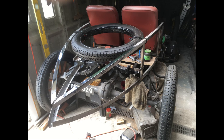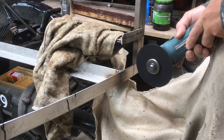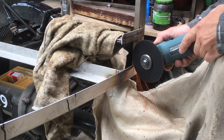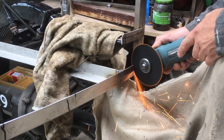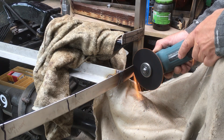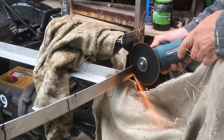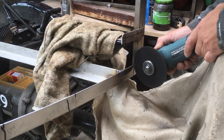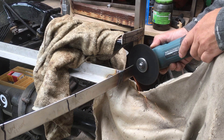With this cutting you'll notice I'm not wearing gloves, which is very, very stupid. Always wear gloves, particularly with these fine cutting discs — if they slip towards your hand they create a very nice thin cut. I almost went through the tendon of my thumb once, just nicked the edge of the tendon and got away with it, but it would have required microsurgery to fix. I don't use guards on these five-inch grinders because they get in the way.